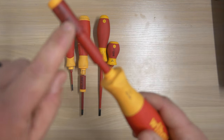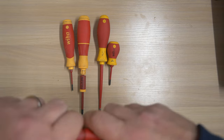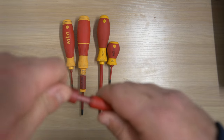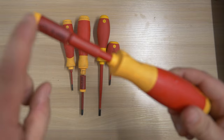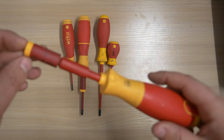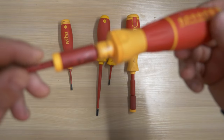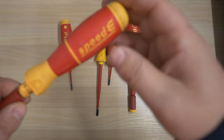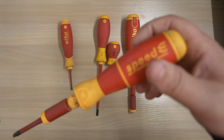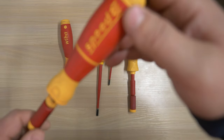I've also got these from Wera - the torque adapter bits. These are absolutely fantastic. You can put them in a Wera driver but they also fit in most other sets of drivers. You've just got to be careful not to put them in impact drivers as they're not rated for that. This particular one is 2 Nm - it's preset - pop it in the end, make your termination, and you're not messing about with a torque driver. I've got another one in the end of the Speedy - this one is 2.5 Nm.